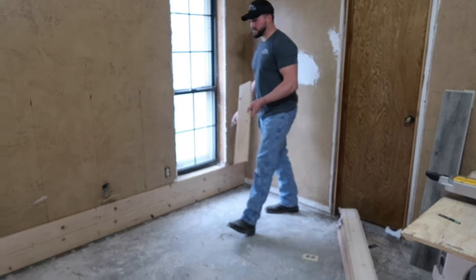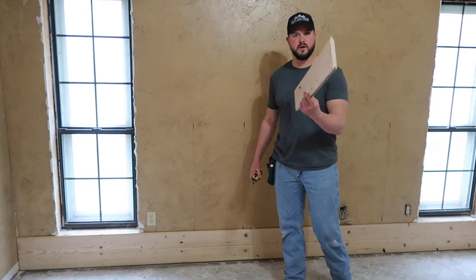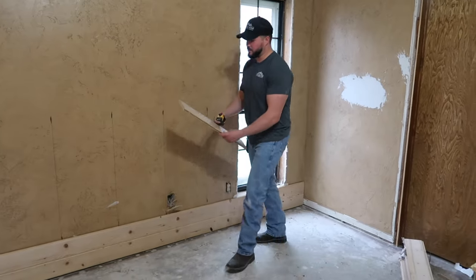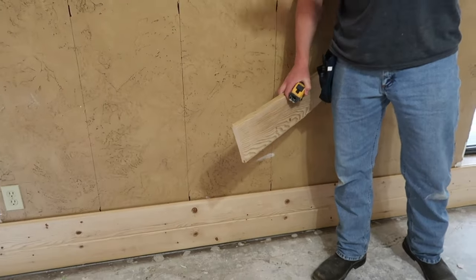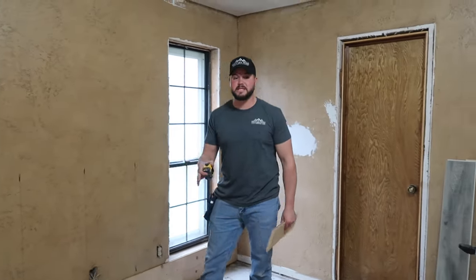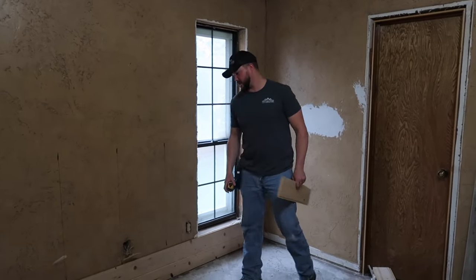I got one inch shot in, went to the middle, leveled it, went down there, and leveled it — got that first piece leveled, because it's the groove all the way up. Really after I do that, it's just stackable. It's not until you start getting outlets and things, but you just stack it all the way up and it'll stay straight across. We buy 16-foot pieces because it's a 14-foot wall, so we don't have to mess with running seams or doing anything like that.